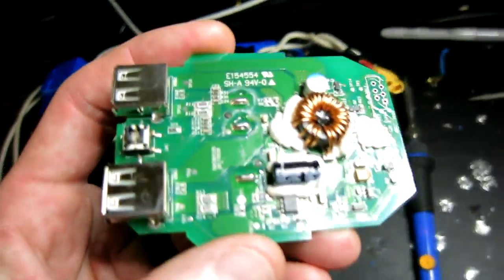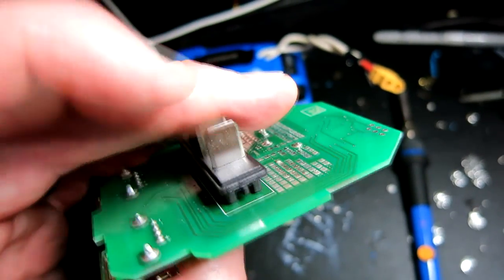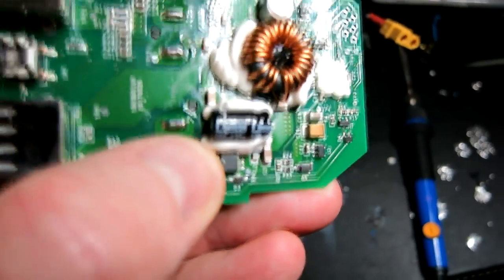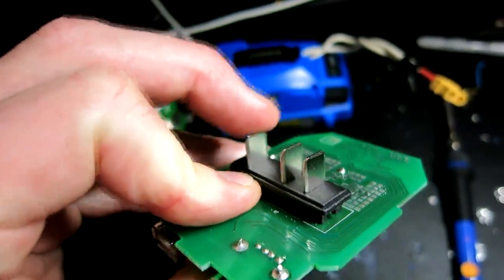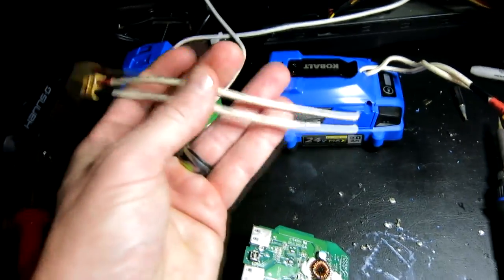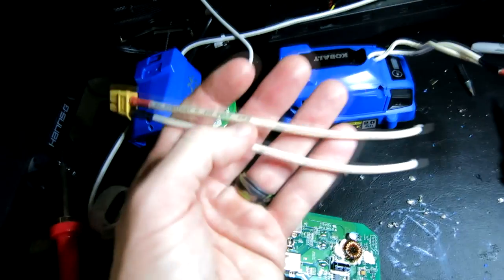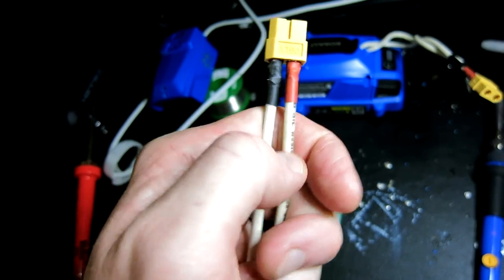Let's take a look at the motherboard of the Cobalt power supply source. We see a solder point right where my thumb is pointing — we're going to solder on our black negative connector there, and solder our red positive connector to the soldering point behind the capacitor. Positive, negative — the middle one we're not going to touch at all. Here is what my connector looks like — 10 gauge wire, about 10 to 11 inches per wire, soldered into my XT60 connector with shrink wrap. I marked it positive and negative since I used the same color wire.